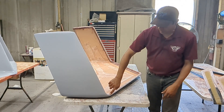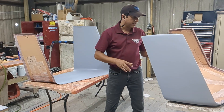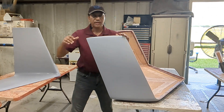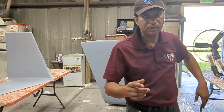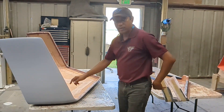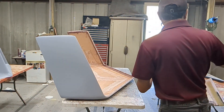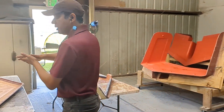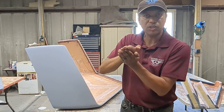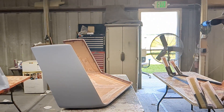So what is this lip right here? When we take this top half and put it on there, there has to be a lip that connects both of these. This lip is where we put structural methacrylate glue that goes on here and also on the backside. When we close the mold — when we put these things back in the mold and close it — that's the glue that's holding the top and bottom half of the tail together, making a sandwich. So think of it as a sandwich: bottom, top, and the stiffener in the middle.